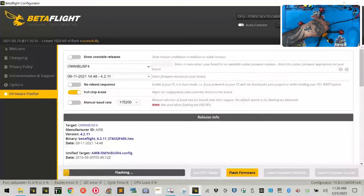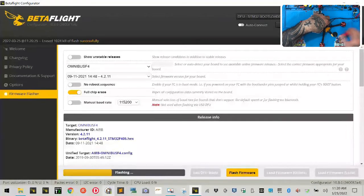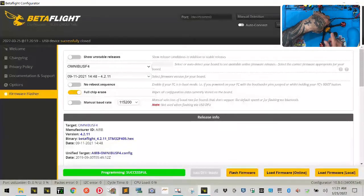I'm keeping my finger over the buzzer so we don't have to listen to it — I don't usually have a buzzer on here but I added one for this build demo. Also note: I switched from the original mount to a TPU mount. The first few kits shipped with the old mount, but going forward we're using the new one, which is quicker to assemble and changes the rear screws from 8mm to 10mm.